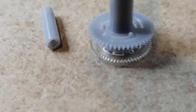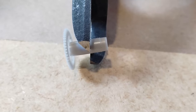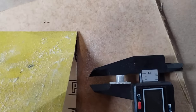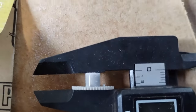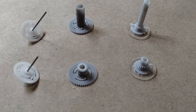As you can see, this one is not binding as I pull it away from the hour-hand, so it is ready to go. We will start off by cutting most of the way with our cutters and then using sandpaper to level the cut and get down to the last millimeter. Do not cut it all in one go as it could crack — instead, cut it bit by bit, turning the gear after you gouge it a little bit. The gear is still about nine millimeters long, so we'll want to cut it down until we get to six. As you grind it down, make sure to keep it level — sometimes you'll have to rotate it. We're at six millimeters. Now clean this up a little bit, and we can move on to the next step. Your three gears should look something like this, with the above being the before and the below being the after.